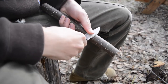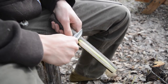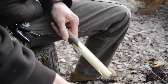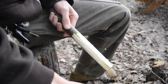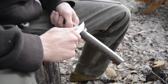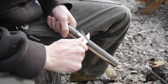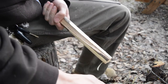As far as the steel goes, this is 1095 made out of files — that's kind of Anza's thing. It performs just like you'd expect good 1095 to perform. Anza re-heat treats these: they get the files in, remove whatever heat treat they have, and then reheat treat them so they have a better knife-steel heat treat. I actually had a long discussion with the owner of Anza about what differentiates them in that regard.